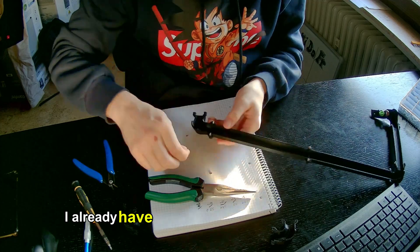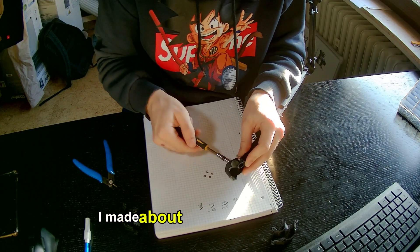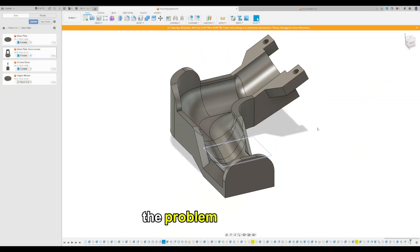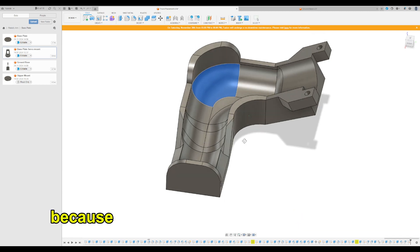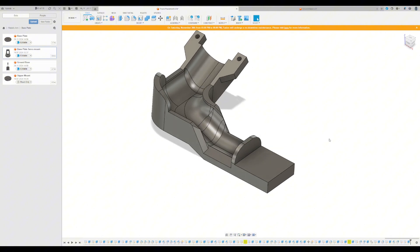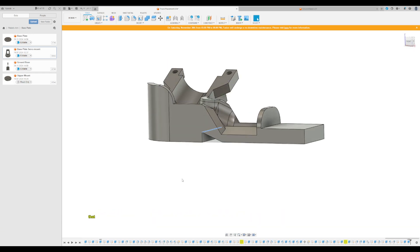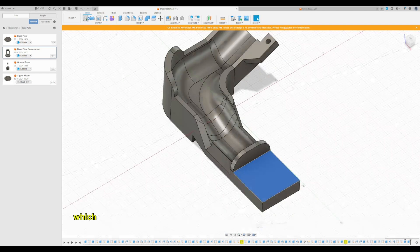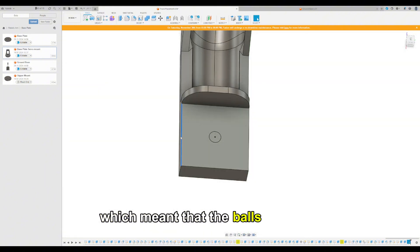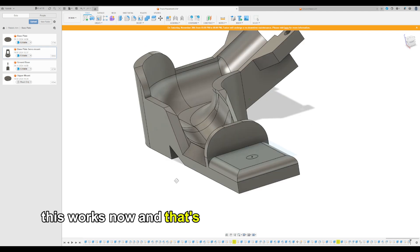Since my last video I've already made parts of the pickup system — about 50% of the whole thing. Now I just have to fix a few problems on the top side. The problem was that the balls were still a bit too fast because the track was a bit too steep overall. I also had to redesign parts because the sections were hanging down a bit, which caused the top curves to be slightly off vertically. This meant the balls were on the right side of the track instead of the middle, so I had to redesign that to adjust it — and it works now.